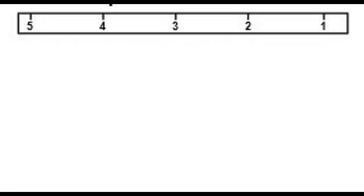And this is what the label looks like. It's just a skinny label. From top to bottom, it's the same dimension as the angled edge of the bezel right below the display window. And the little tick marks align with the spacing of the decimal points on each of the 5 least significant Nixie tubes. And then the numbers correspond to the right-hand column in the chart.